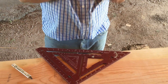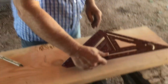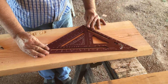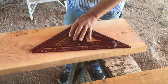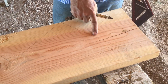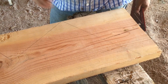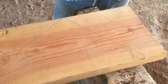I'm going to use the Smart Square Pro, continuing to use it in the 180 degree detent, to do my last squaring process — nudge it to the line, and that'll be my cutoff. I'm going to drop it down 7 and 3/8ths, subtract the width of my treads which will be an inch and a half, so that my top step has an inch and a half stair tread on top of it. Then I'll square that across and I'm going to start cutting.